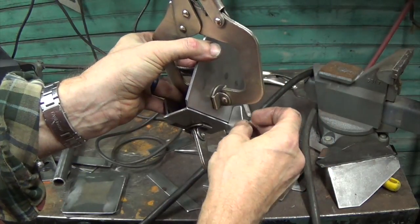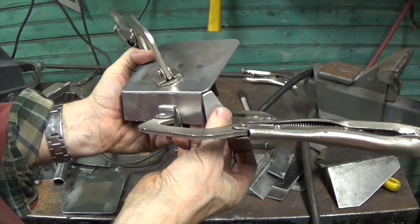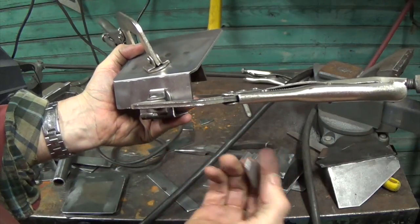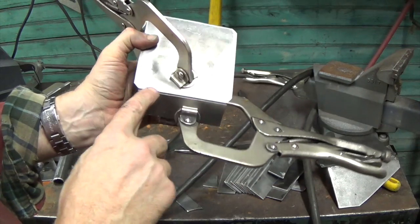so that the weld metal just fills in that gap, that's all. And I'm going to do it on the torch. I'm sick of this porosity. And then every other one I want just a tiny little gap there. I guess I'll grind the tops of these so that I end up with a tiny little gap like this.